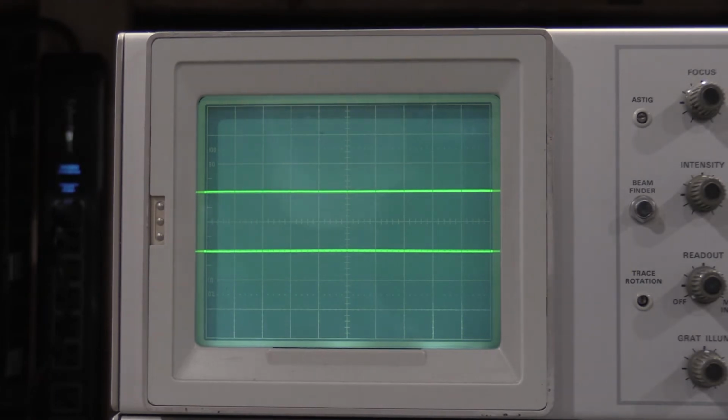Okay, 11, which is the vertical amplifier centering. It does say that it typically does not need to be adjusted, and I haven't replaced the CRT or any components or anything like that, and the acquisition unit has always been with this scope, so I'm going to skip that one. But it does want us to adjust the vertical amplifier bias. So I'll figure that out real quick, and then we'll go from there.